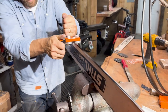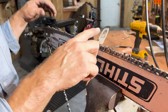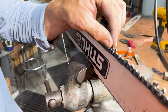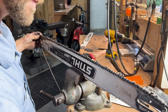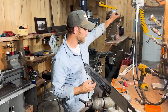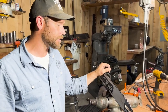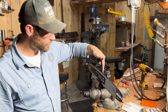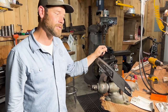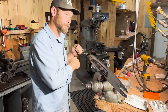As you run the squeezer it wants to raise up, so put downward pressure as you go. Do a test fit — now it's not just falling out of the rail. There's still some movement but it's a lot nicer — we'll call that good and do the other side. If you squeeze it too tight you have to reopen it — run a bar tool or flat head screwdriver in there, tap the end with a hammer, and spread it out. You have to run the whole length you over-squeezed. Do baby steps and keep test-fitting.